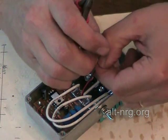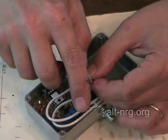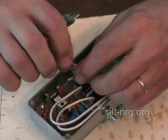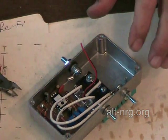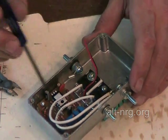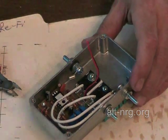I connect these a little differently. You can connect these directly to the positive and negative input terminals of the PC board and that's perfectly fine. But for an added measure of safety and transient suppression isolation for the fan, I connect the positive terminal to the downwind side of L1, which is the 100 microhenry 4.3 ohm inductor that replaces R14. The 10 ohm half-watt resistor can work but it doesn't lend itself well to adding any additional load like the fan.